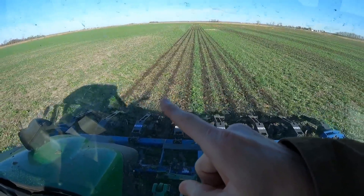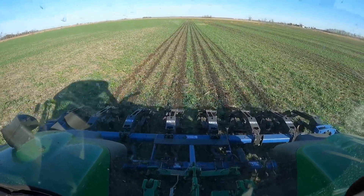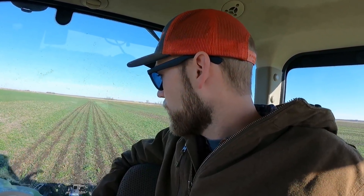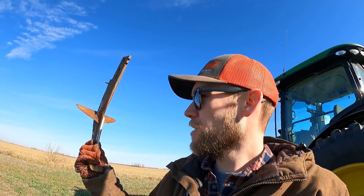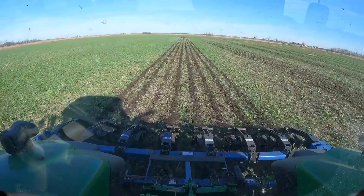The row is doing a little better job but I still don't like it. I'll run it for a while and see. This farm is a little variable — some low heavy ground and some higher sandier ground. In the lighter ground it's doing a really good job, but in the heavy ground I think it just needs that wing to lift the soil up and make a nice berm. Made a couple more rounds, still not happy with it — going to try yet another knife that's not quite as worn out as the one I was running yesterday.